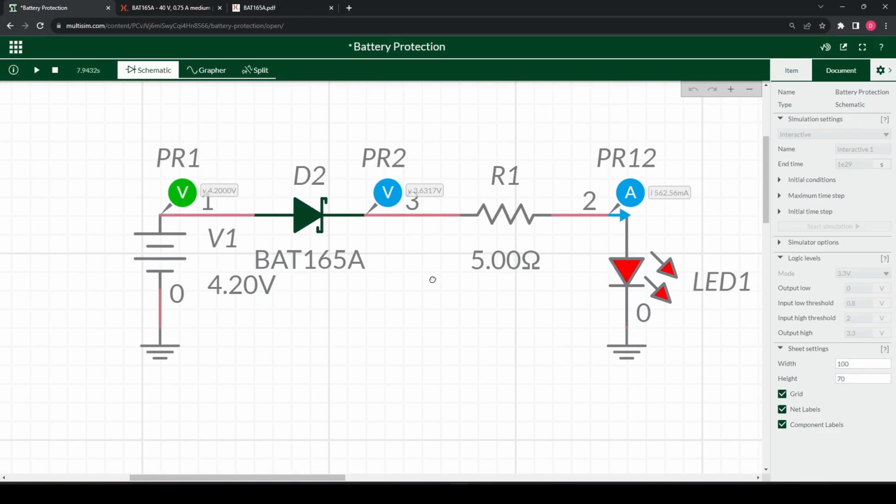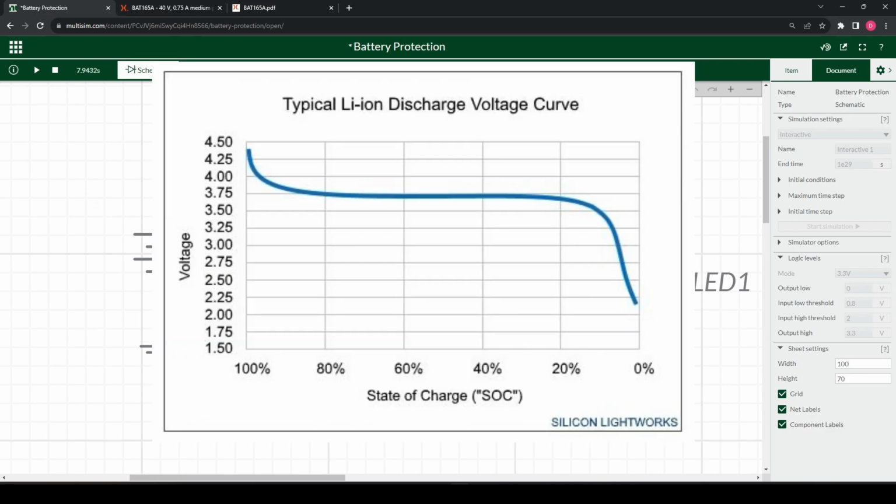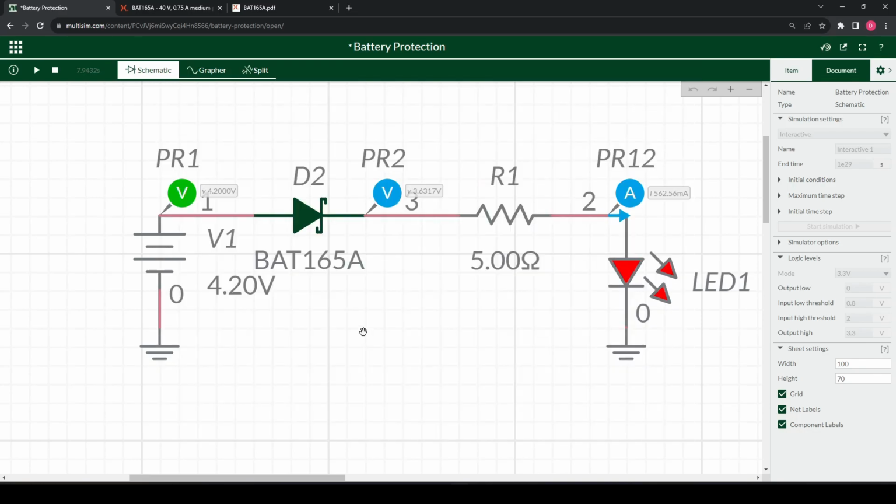So if you remember the curve I just showed you on screen, you can already see that at certain areas of the battery, we have most of our energy. This is really crucial in wearable applications. So for example, if your wearable device draws this amount and you've decided to place this in here, or you've had a much larger, chunkier Schottky diode or something, you'll notice that, oh, I'm already in that long period. I've already lost some percentage of my battery. It's not that ideal. Maybe for smaller projects it isn't ideal.